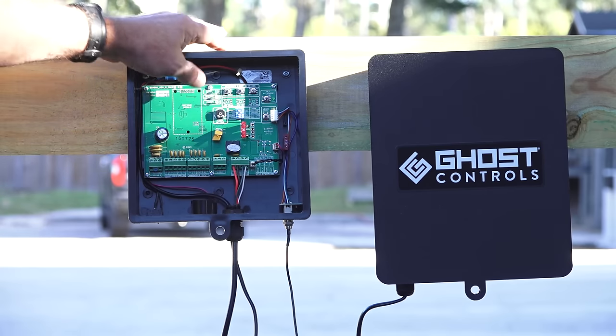This system is operated by battery power, and you must select either solar power or AC power to charge the battery. An AC transformer is included on all non-XP units. If you choose AC power, you may run a low voltage wire — not included — to an outlet that is not more than 1,000 feet from the control box. Attach the low voltage wire to the control box as indicated. If you're using solar power, choose the placement of your solar panel with the maximum amount of exposure to the sun. You may extend the wire length up to a total of 100 feet using not less than 16 gauge stranded wire.